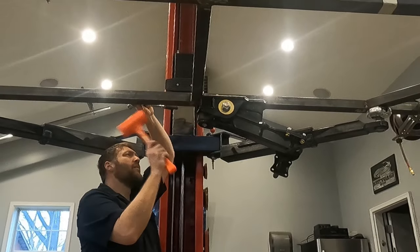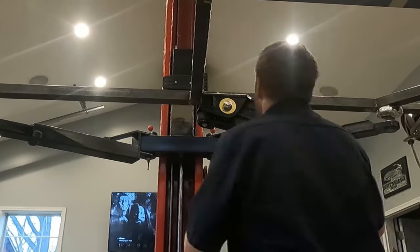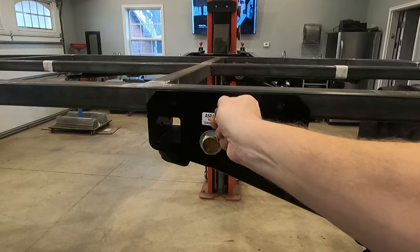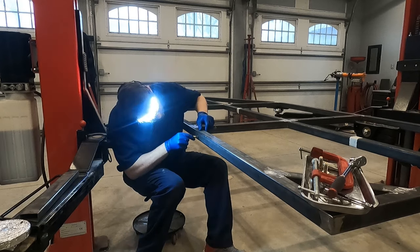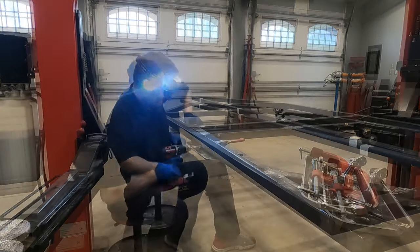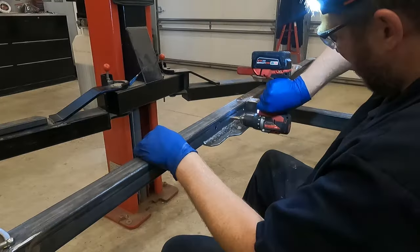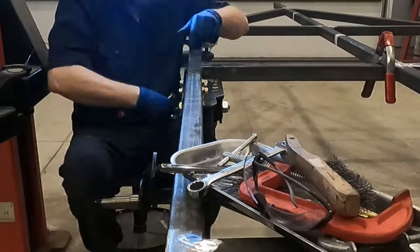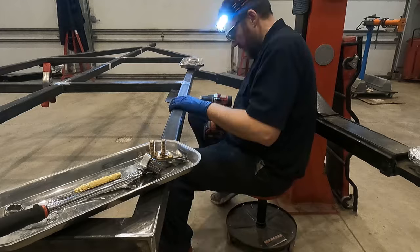After taking measurements, I had to do just that — slide the arm to the exact location. Once I was satisfied with the exact location of each side, I tightened down the two bolts on top to get ready for the other attachment points. There are three main bolts that attach the swing arm onto the frame. Since I don't have center transfer punches, I used a small nut on the end of a spring-loaded punch and used the hardened steel to make a little circle inside each of the holes. After removing the suspension, I drilled the holes in the correct location, used a small magnet to chase out any metal shavings inside the frame, and then installed the suspension back onto the frame. I used the same process on the passenger side to get the holes drilled in the exact locations.